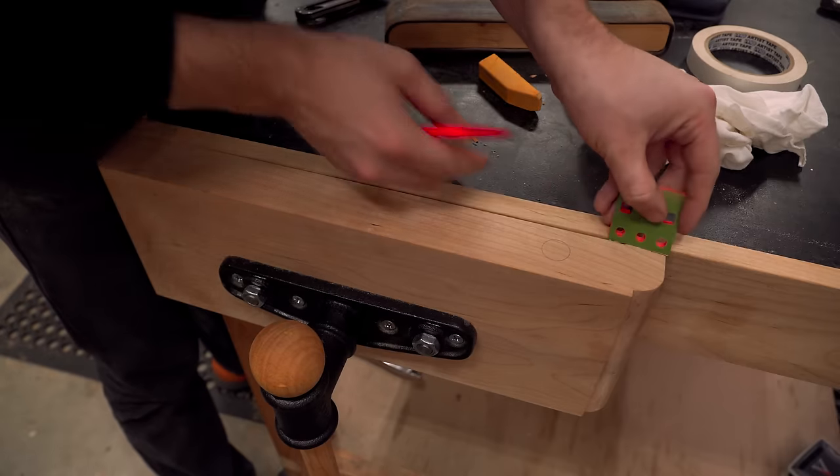The smaller vise also had an issue — it was pretty gappy on the right-hand side — and the only way I could figure out how to fix that was to plane it out. So I drew a line parallel with the outside of the table, removed the jaw, and got to use the big vise for the first time. I'm very new to hand tool woodworking but it's something I've always wanted to explore. I think I'll always be a power tool woodworker, but I'm learning and really enjoying that this is something I can solve quickly with hand tools. This really illustrates why I'm putting vises on this workbench at all — so that I can grow as a woodworker and become better at my craft.